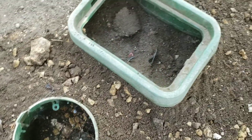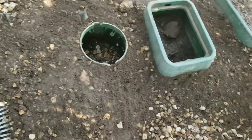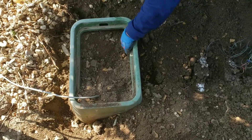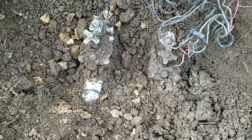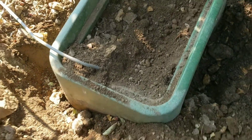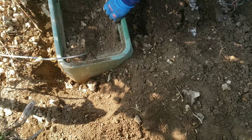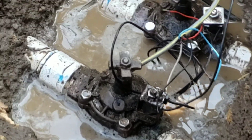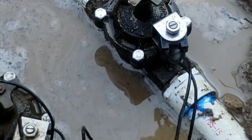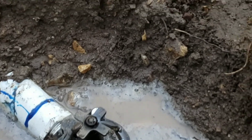The gophers are very bad out here — they take over and create bigger problems. They came in here and started digging through, filling the valves with dirt. They mess up the washers, and little grains of rocks get stuck between the valves so they don't close the right way anymore. These are our brass valves and we're going to check how they look up close. We changed three of them and two are left. We asked if they wanted to change both even though one was still pretty good, but they said no. Thanks to everybody that watches — please watch the update later.